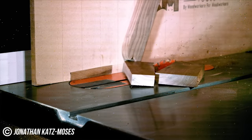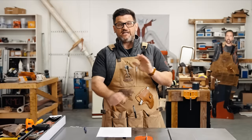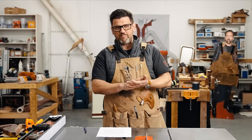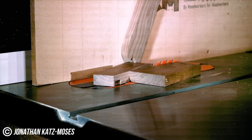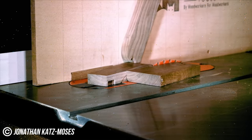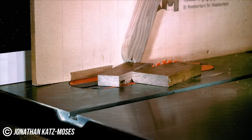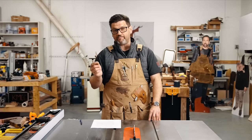This shot actually really hurt my hand, because as it pinched between the blade and the stick I was using to push it forward, my hand was on the other side of that board holding a handle, and the impact gave me a bruise on my palm and definitely shocked and scared me a little bit. You get a much better look at how this happens: the board is turning towards the blade, and as it grabs it, it goes over the top of the blade like a slingshot, and this isn't the only way that this happens.